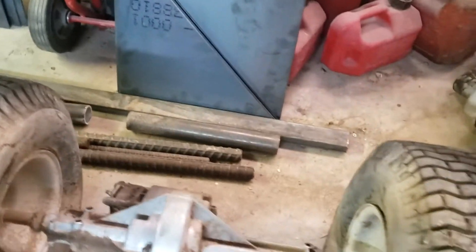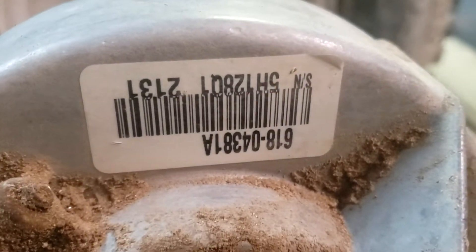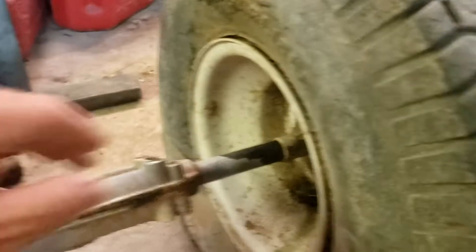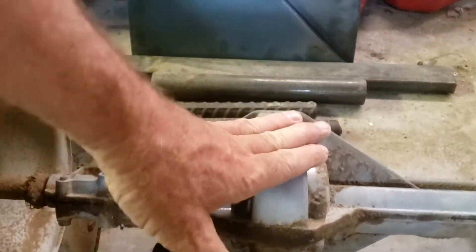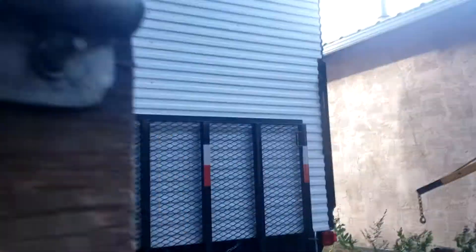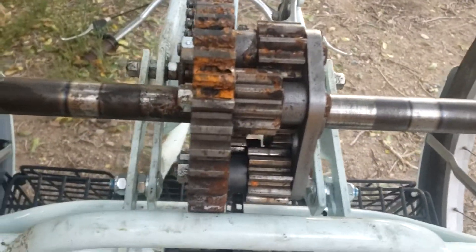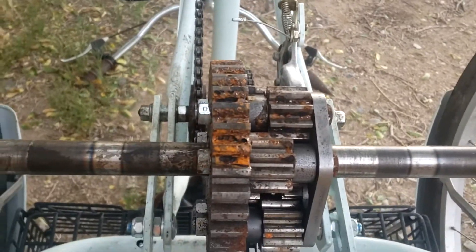I have got a transmission. This came out of my best friend Brad's Troybilt. This is upside down, but there's a code for this — it's a transmission where the shaft appears to be a three-quarter inch shaft. That differential in here should be just about the right size for our application as a differential for the trike, and it should be quite a bit smaller than this one, which has a one-inch shaft and quite a bit more metal than we would need for a tricycle this size.